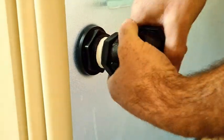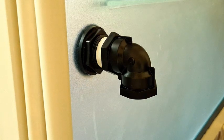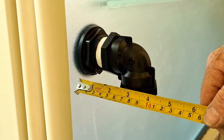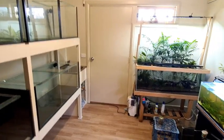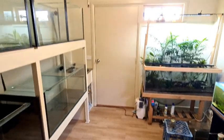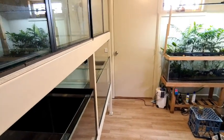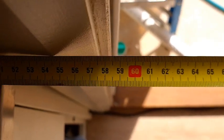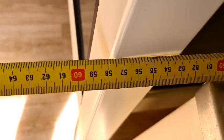So now instead of having a glued elbow we can screw on an inch threaded poly fitting — this means it can all come apart and we can remove the tank. Now the big test: what's it measuring at? You can see there it's a fraction under four inches or ten centimetres. We've saved an inch or about three centimetres which doesn't sound like much, but in a fish room this small every little bit helps. The main reason was that if the rack stuck out past the doorway we'd be in a lot of trouble bringing big tanks in. The doorway is 58.5 centimetres out from the wall and the rack is about 57.5 centimetres — it'll be tight but it'll be doable.